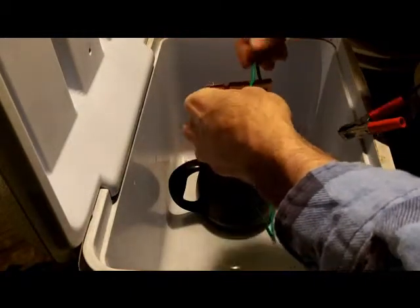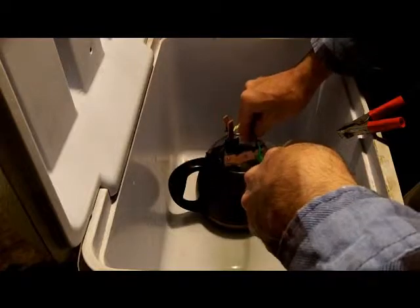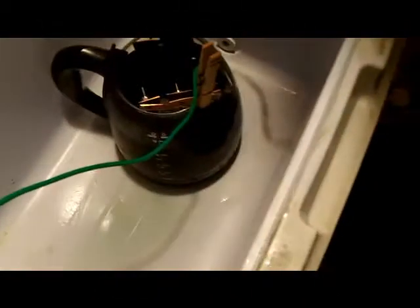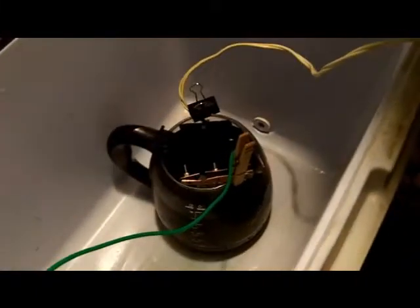I'm going to be a little more careful about the level the anode is submerged at — you don't want the metal above the waterline. This is a regular UPS power supply that was thrown out at work; these things are easy to come by. I'm going to plug the positive terminal into the anode and the negative terminal in — make sure these things don't touch and short out your circuit. Negative to the cathode — that's where the metal gets deposited. Positive over at the anode, where I have my carbon graphite pulled out of D-cell batteries.